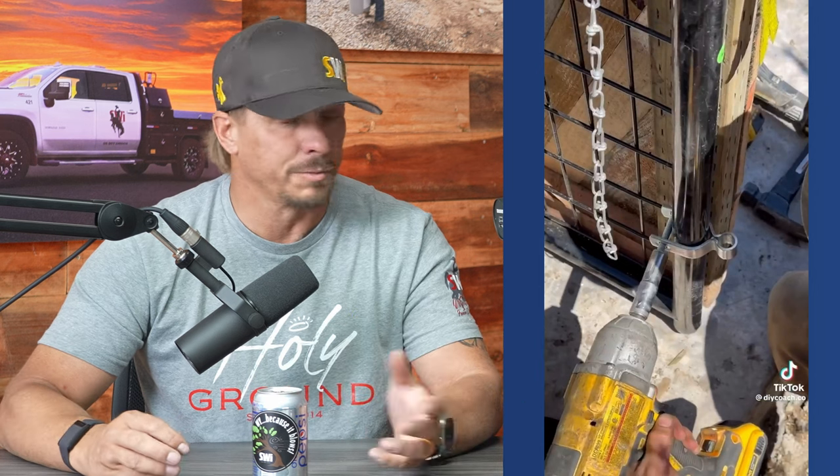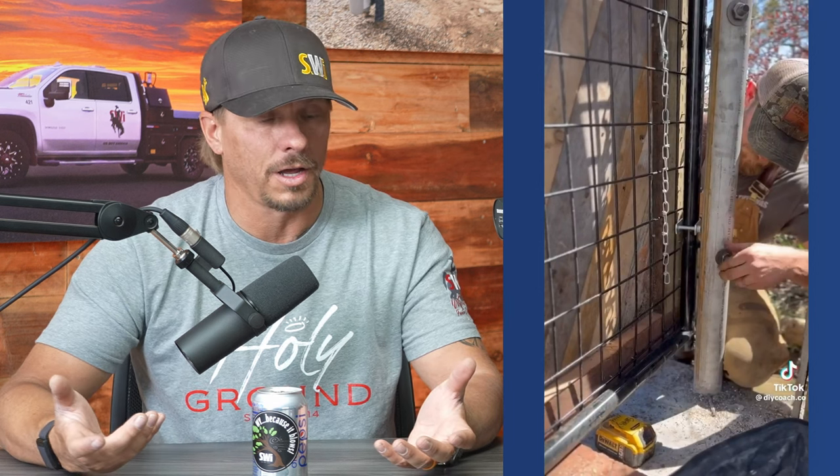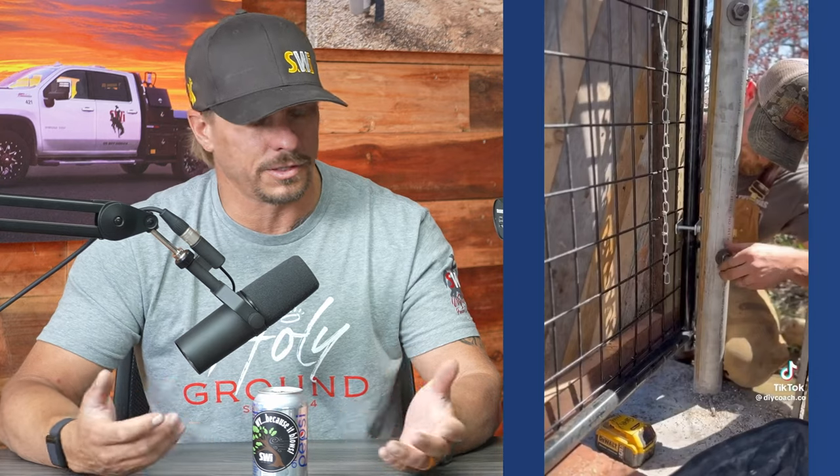We're using a store-bought frame, and this frame is even worse than the last one. This is definitely an 18-gauge frame and it's inch 5/8 — very, very light-duty, which means you really can't weld to it. All the weight is probably going to tear through the steel over time, or it's going to sag and bend. It's not even a good base platform to begin with. The schedule of that gate is meant to hold the weight of its own self, not additional weight of additional materials.